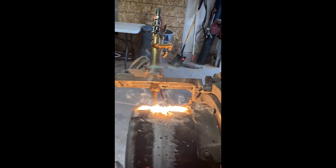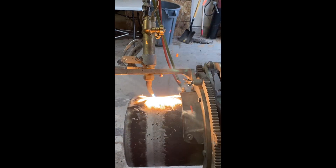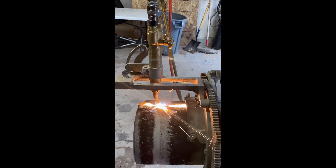After you've made your first initial pass around the pipe to burn the paint off, you're gonna go around one quarter like this, just to keep the pipe nice and warm and get a preheat. A good preheat will make a good cut.